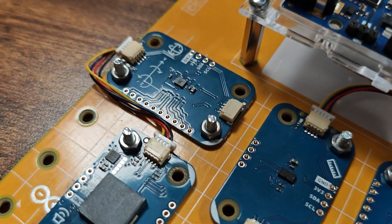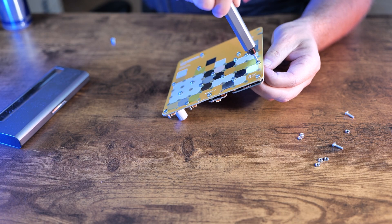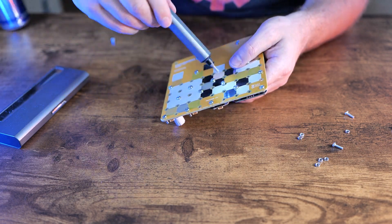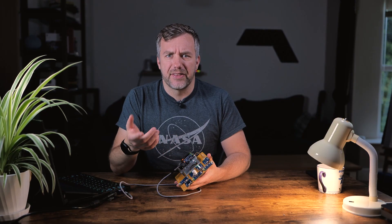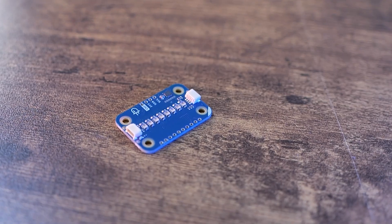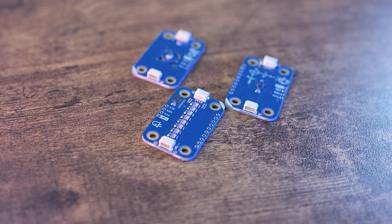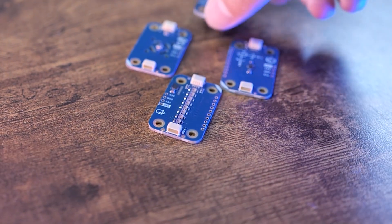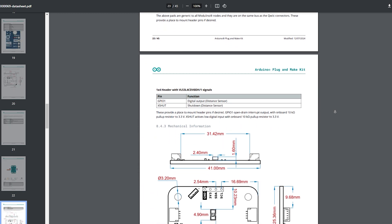The pitch of those through holes is exactly the same as on a breadboard, so you are not limited to interfacing with them through the QWIIC connector. Thanks to the mounting holes in the corner of each board, you'll be able to utilize these boards in your prototyping projects as well. Those holes are pitched 16 and 32 millimeters apart, which matches the pitch of the boards on the yellow PCB. On the opposing side of each board you also have additional pins broken out — depending on which module you're dealing with, you'll have access to protocols like UART, additional interrupts, or SPI.